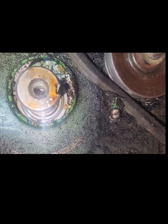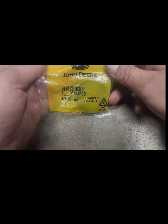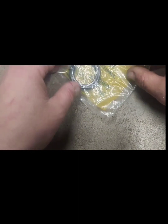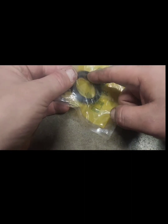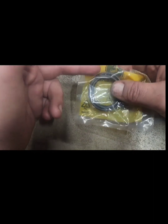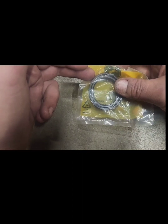Now we're going to get a rag and clean all this up, get it nice and shiny. The new seal part number is M124523. My preference: I put some anaerobic gasket maker around the outside of the seal, and anti-seize or oil on the inside lip. The gasket maker on the outside seats it tight against the crankcase, and the oil on the inside makes it slide in easier - less chance of leaking again.